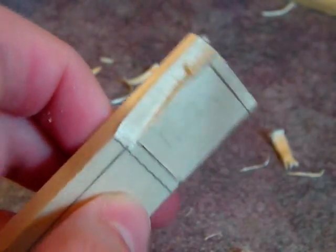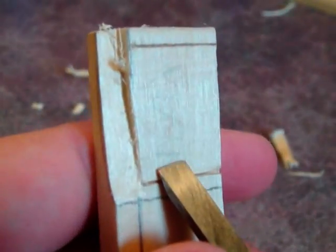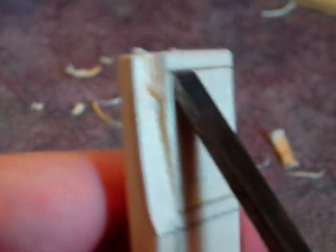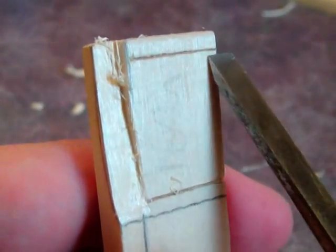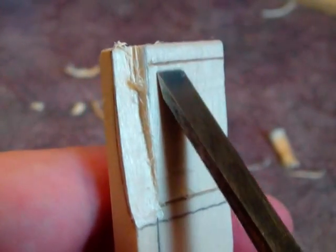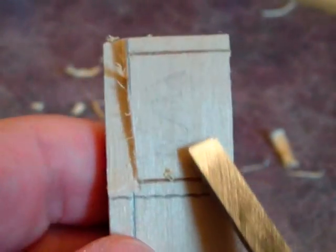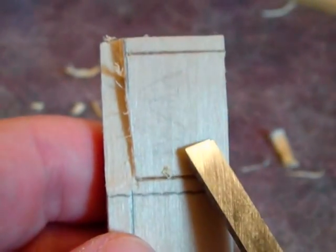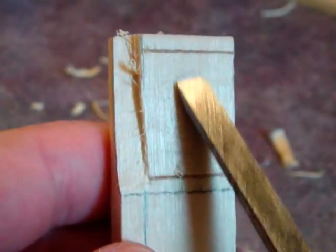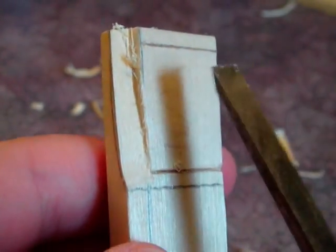So it's the same process essentially. Once you have a good idea of how this line is starting to shape, you're just going to follow that line further in. And remember, this line right here has been scored, and for good reason, because that's going to be your barrier. So that's really the time to be gentle with it, because especially on this piece, the grain is going that way. So if that was not scored, it'd be easy as pie just to slide the chisel right through the whole piece. Not as much fun as it sounds.